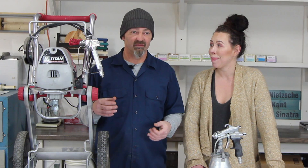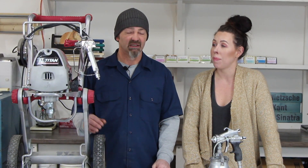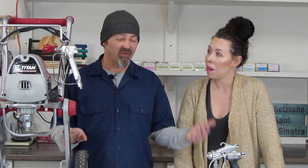What about clean up? To me, the big con of the airless — unless you're doing big jobs or batching a lot of pieces at the same time like we did in this video — is that it's a lot of setup and clean up. It's a lot of extra time and extra work. That's where the HVLP system is better — it's much easier to clean up, or just switch colors by changing a gun. You can run sealers, paint, and primer all in three different guns at the same time and not have to clean up between each one.